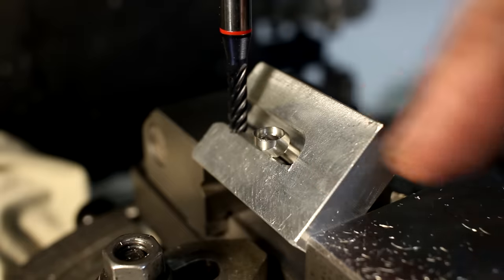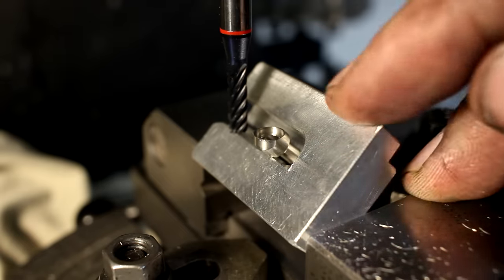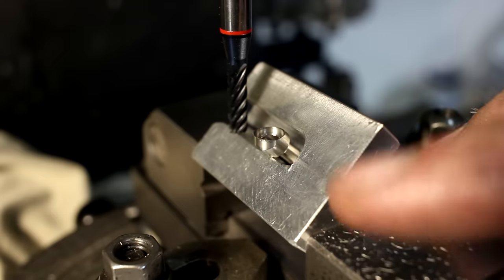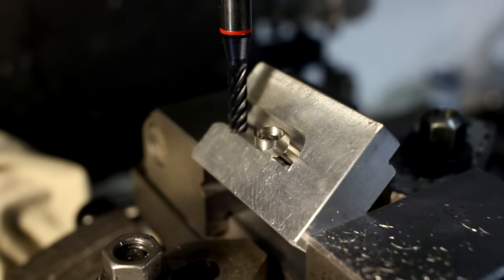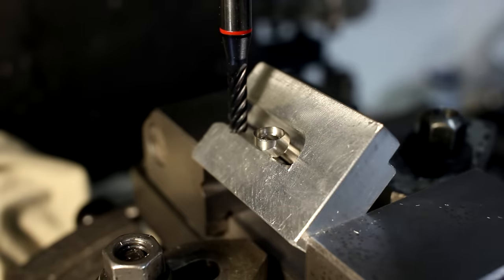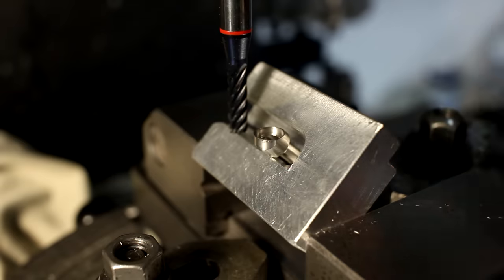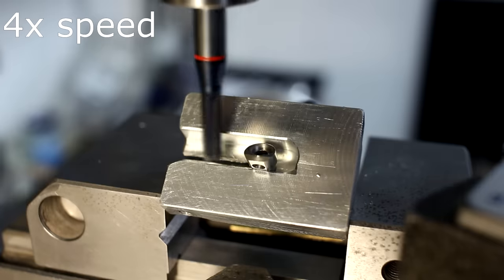You saw me just swinging the radius, took it in two passes at full depth with 0.2 millimeter allowance radius wise, and then a finishing climb cut to final dimension. And I have to say, this works quite well and goes quite fast. So let's do the other 10. This was just a setup piece.